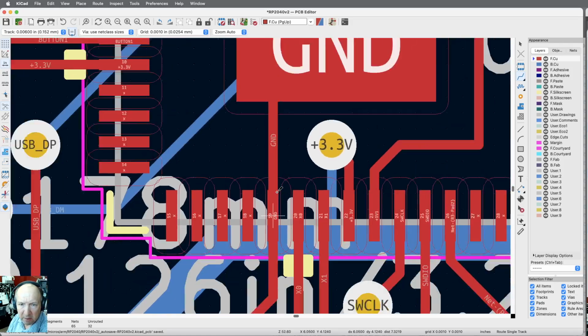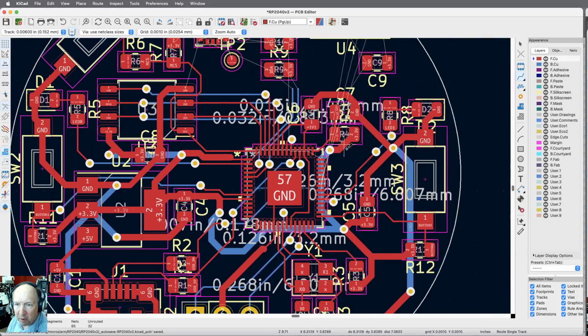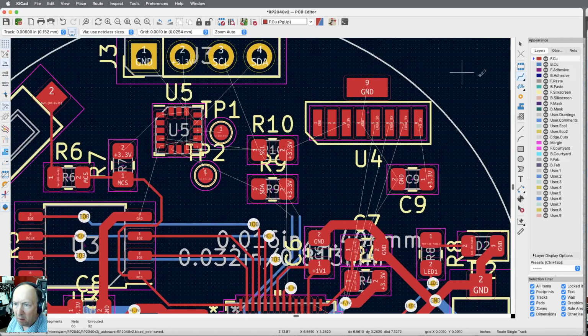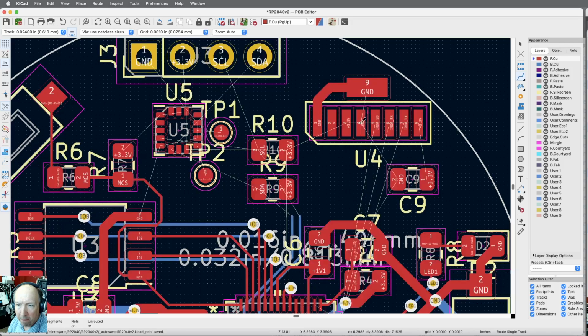Okay, what else we got that's wires? I've got these 3 that need to go up. And they need to go all the way up here. And the blue traces are the only thing that's getting in our way. So we should be fine to get all 3 of those up. And I've got this part here that needs to connect in. So that all looks pretty good. I need power and ground. And so that should be good. Let's see, what else? What else is ground? Ground is on pin 1 and pin 4. So let me connect those just to get their traces a little smoother. 24, just because I can. And then I need this to go to ground. Well, how convenient. There's a ground right there.